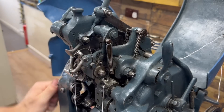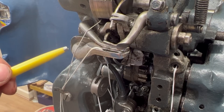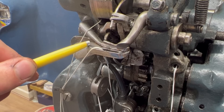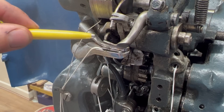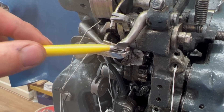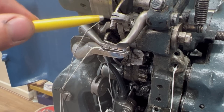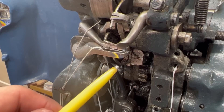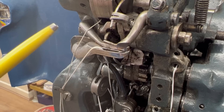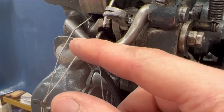Now I'm going to show you the different parts quickly. Firstly we've got the table bed - that's what the shoe sits against. Then we've got the table guide, which is adjustable backwards and forwards so we can get the shoe in the right position. This is the guide arm which sits down and holds the shoe in place. Then the needle, the needle guide, and the awl - that sharp little spear that's going to poke up through the bottom of the shoe. And then there's the splitter which I'll show you in a minute.